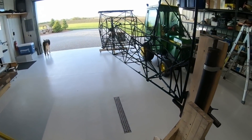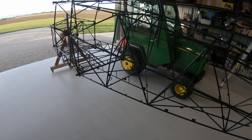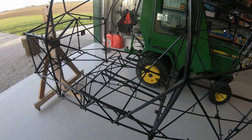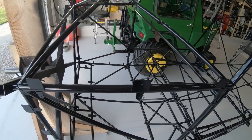I sprayed two top coats and they take longer to dry — about an hour between each coat. After you're all done it takes even longer to dry, so typically I'd let the parts stay in the paint booth overnight before moving them. If I were to do this again, I'd use this paint again but probably just spray a heavier top coat. The heavier you put it on — without letting it run — the smoother it gets.